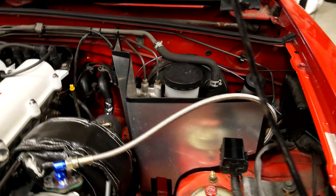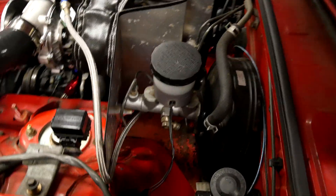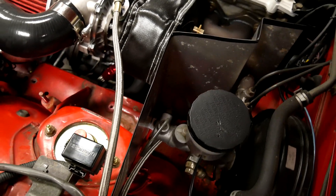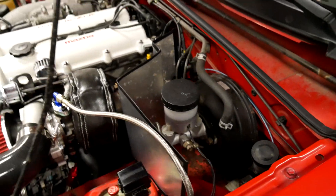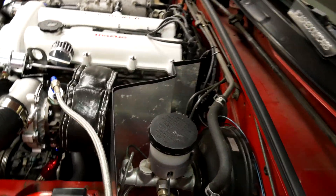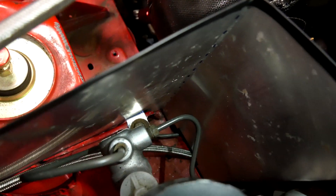The very last thing I did was file down the edges and trim them up with tape. This prevents cuts and cleans up the heat shield just a bit. Note that the heat shield has an air gap between the downpipe and the shield, and there's also a gap between the brakes and the shield — this is what you want for maximum protection.